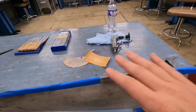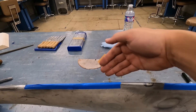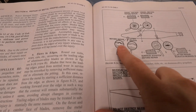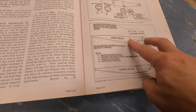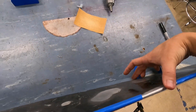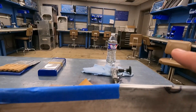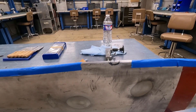I've flipped you around to a first-person point of view. I've got the propeller looking at it from the back — this is how it would be affixed to the aircraft, with the cowling on that side. I've drawn a Sharpie mark in that nick and circled it. According to my instructions, this is the beginning, this should be the end, and this is my repair criteria. It tells me the maximum depth is 0.3 of the chord length. One of the biggest problems I see with my students is they file these off flat, leaving a flat nose right there — we don't want to do that.